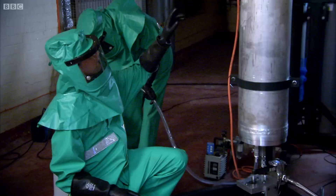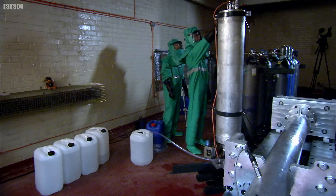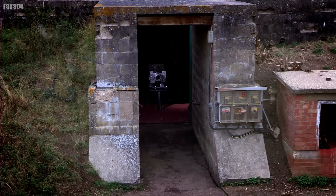The next stage, which can only be done once we're clear of the building, is it gets pressurized by those nitrogen cylinders there. The pressure it's pressurized to means there's probably about 50 tonnes of force trying to burst the top and bottom off that tank. After helping Daniel to load the HTP oxidizer, we slowly open the valve to 800 PSI, before retreating to the safety of the monitoring bunker.